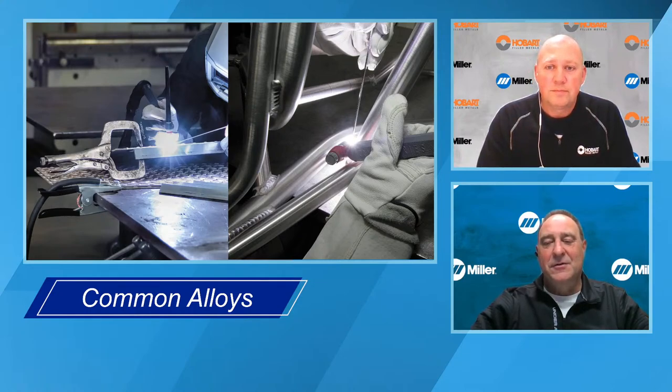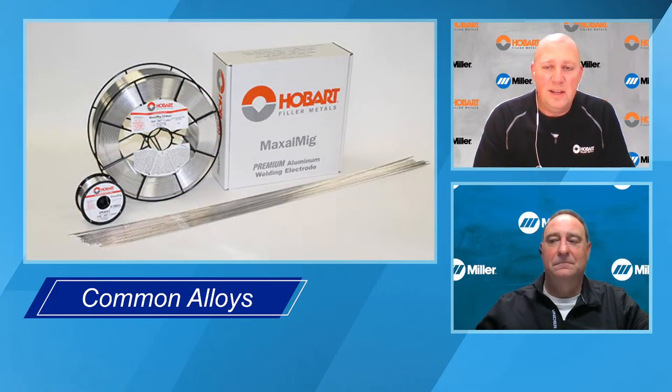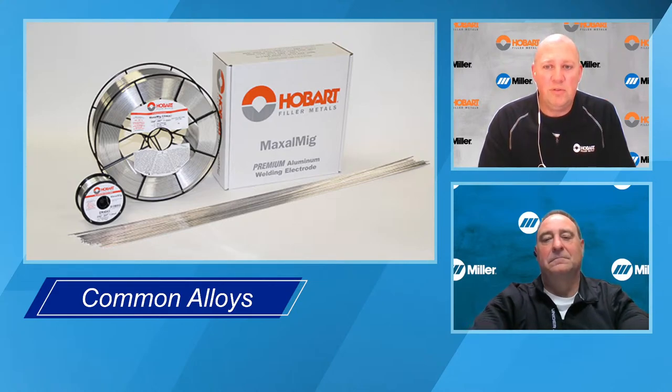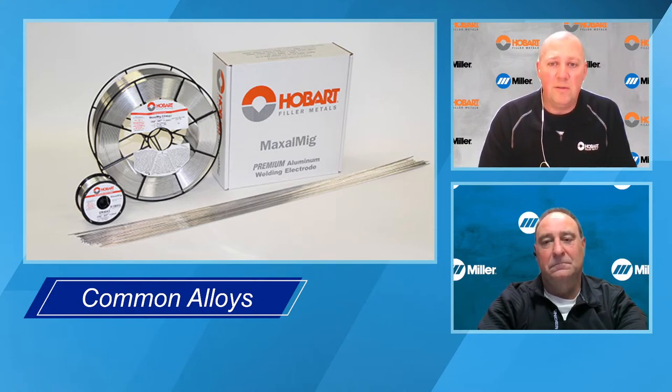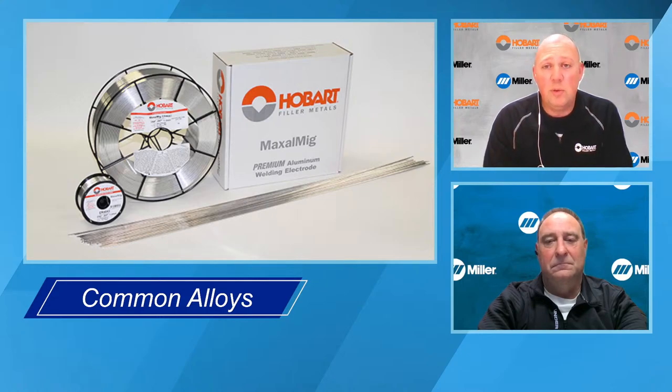Real good. So we talked a little bit about base materials. Now, can you talk about some of the common aluminum filler metals? Yeah, if you go into any welding distributor in the United States, almost every store will have at least two different alloys in either MIG or TIG. The two most common are 4043 and 5356. The reason almost every distributor carries those is, I would say probably 80% of the base metal combinations can be welded with those two alloys.